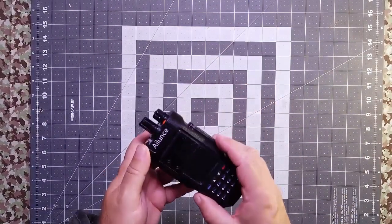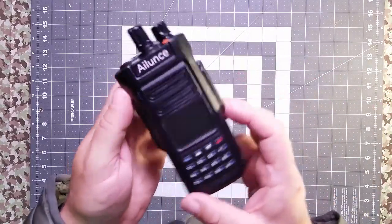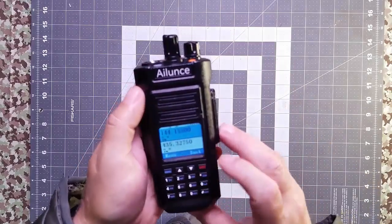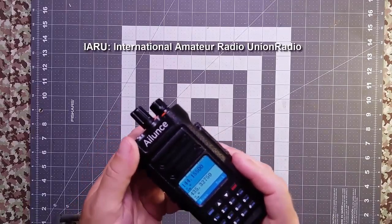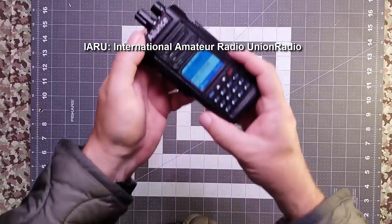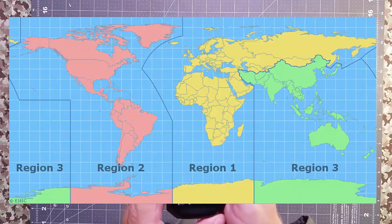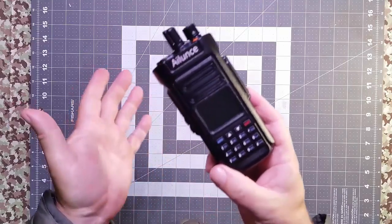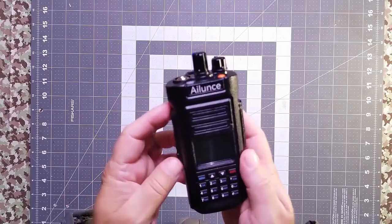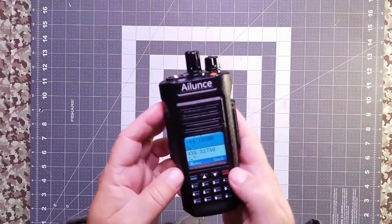Back to the program. Now, with that said, this radio does support NOAA frequencies that you can listen to but not transmit on. Also, the radio can operate on three different IARU frequency range setups. Ours is the United States, and this thing will operate on 144 through 146 megahertz, or 430 through 440 megahertz. And it has a capacity of 3,000 channels, which kind of blew my mind,